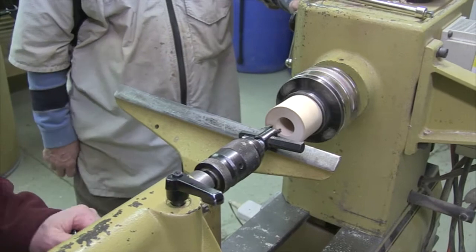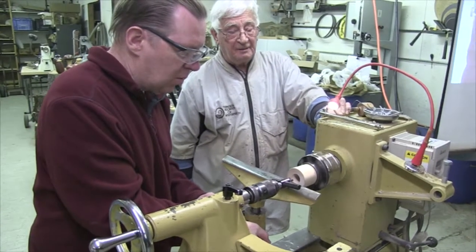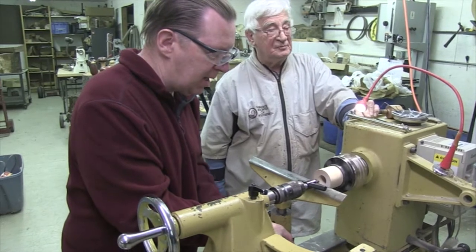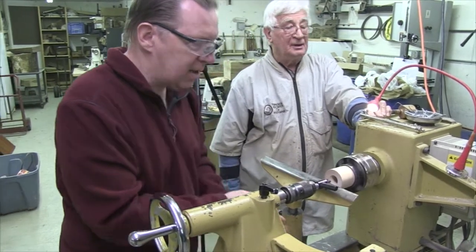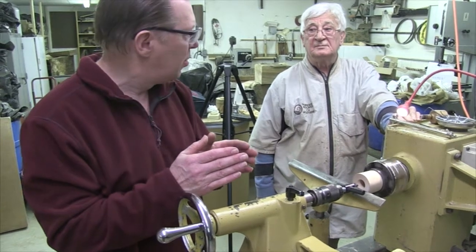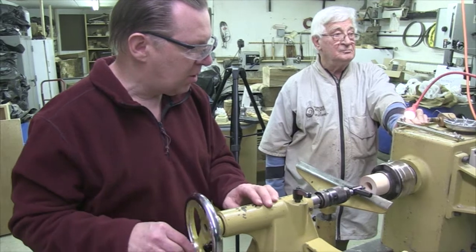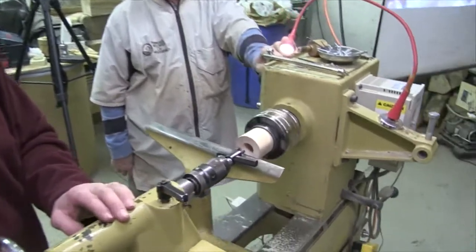Ready? You want to explain this? What I did is come up with a little fly cutter, which allows us to cut both the male and the female, and the space in between is that 1.2 millimeters, there's a little spacer in between. And so what we do is we just switch that spacer.